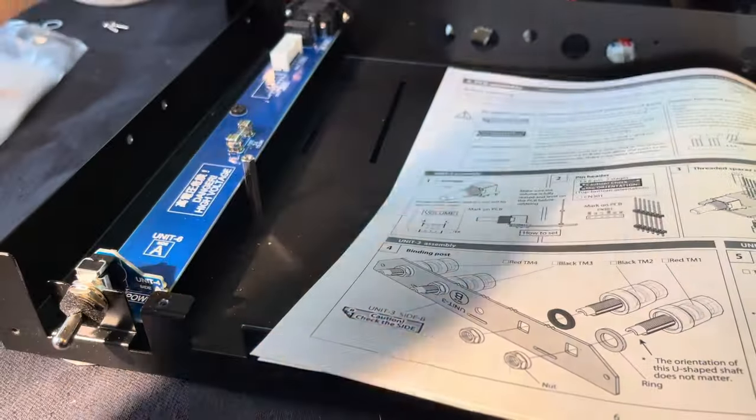The signal goes into this tube and there are two sides — it's like the equivalent of two transistors in one envelope. Half of the tube handles the first stage of the right channel, and the other side handles the left channel. I believe there are two gain stages in each one, but I think they're used in parallel to get more current. The last stage is these 300Bs, which is what the amp is named for. All these tubes are Electro-Harmonix, made in Russia.